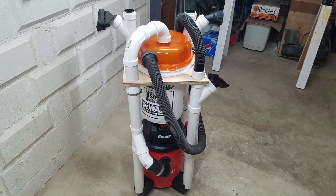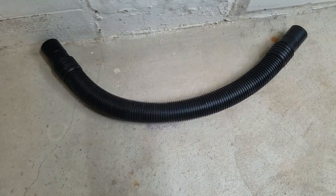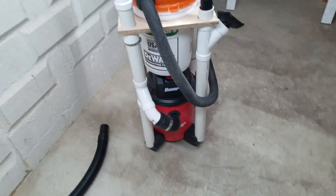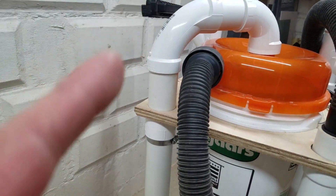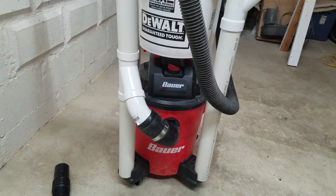I've been using it for about two weeks now and I'm really happy — it rolls around nice, compact, efficient, effective. I don't think the PVC could possibly be more restrictive than that accordion ribbed stuff. I've been in the mechanical trade for a number of years, and anytime we can get away from ribbed material we use smooth-wall PVC pipe. Use that long sweep 90 — it almost looks like it was made for that application. Air is lazy, so help it where you can.